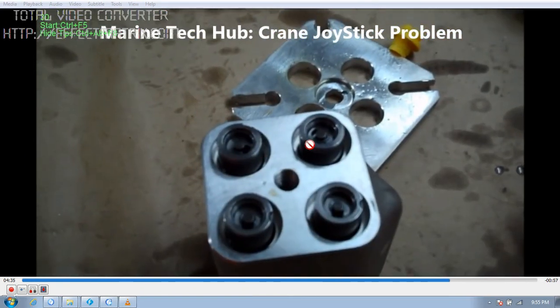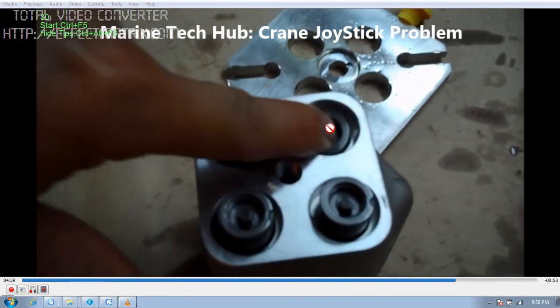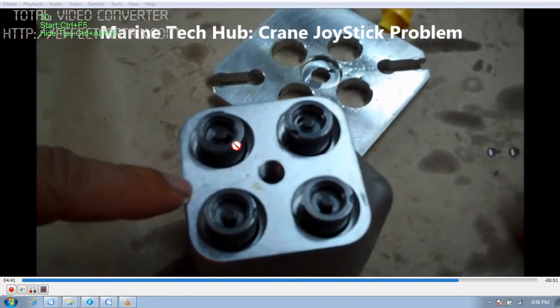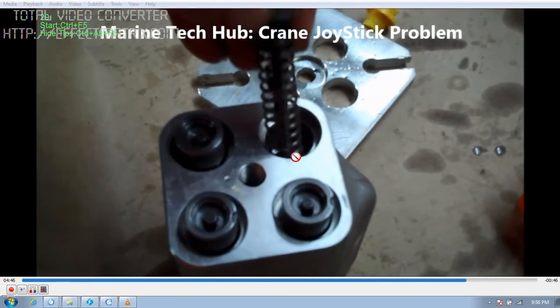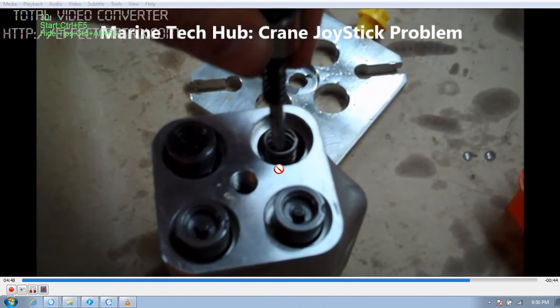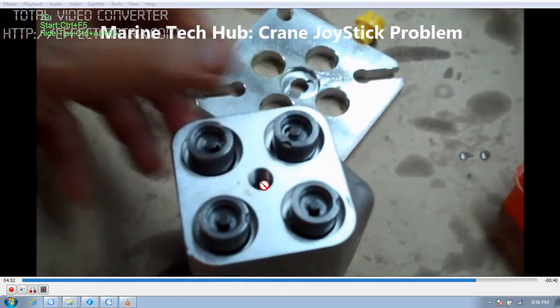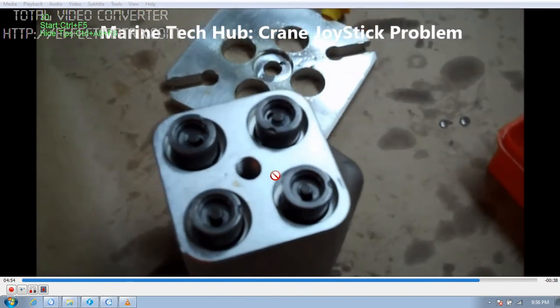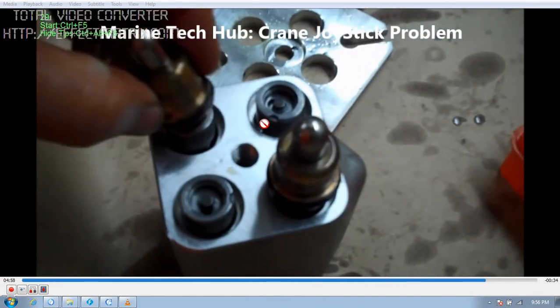You can see I have put all the units here. If you press it, the spool should go freely. Once you assemble it, you can use it for the next operation. Where the joystick leaks, you can in-place replace the o-ring instead of taking the whole joystick out.